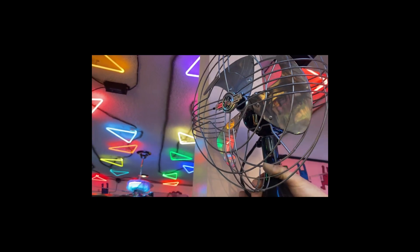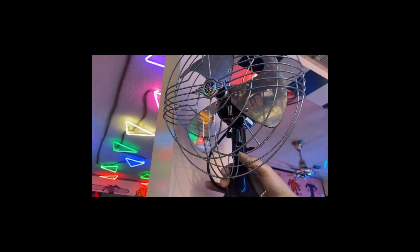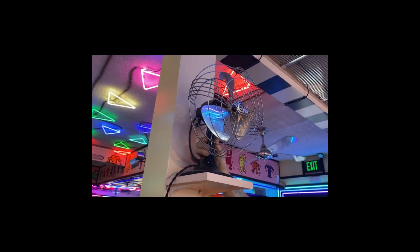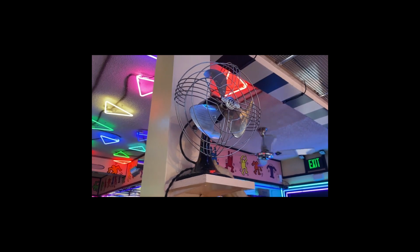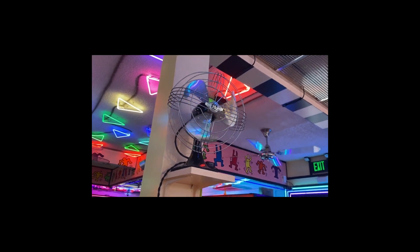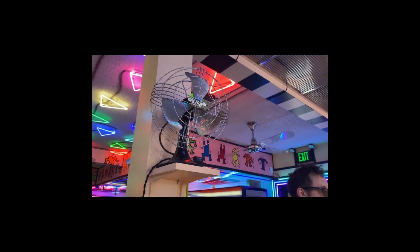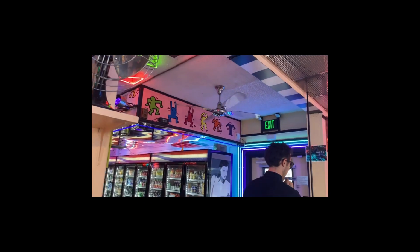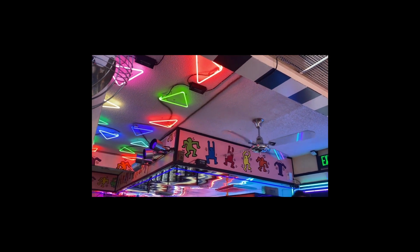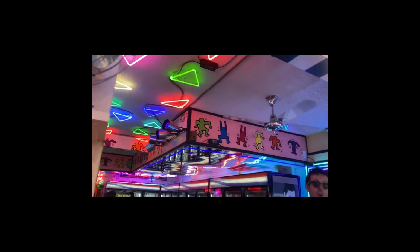You guys just hung that Rotaire on the ceiling. Yes, I saw the video of that just come out. That thing has moved some damn air too. What we did with that was we just kept it on a light switch. There was no point in a solid state control, because if you turn it too low, you're holding up the gears that rotate it. You'll wreck the gears.